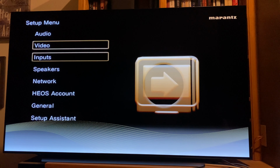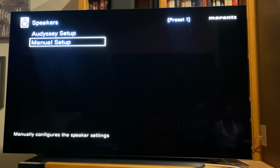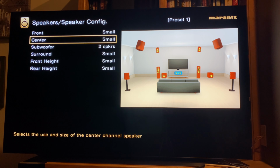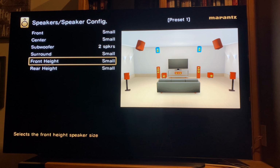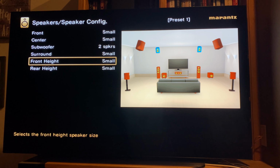I'm trying to make this quick video on your speaker settings and why you should basically set it to small. I played around over the years with large settings and small settings, and depending on your AVR and your setup, for a while I couldn't distinguish which one sounded best, and I kept going back and forth with large and small because I wanted to produce the commercial theater sound. A lot of times I was trying to set my speakers to large so I can get more bass coming out of the speakers. So that's why I was trying to do large.